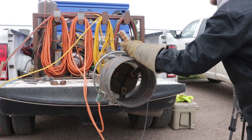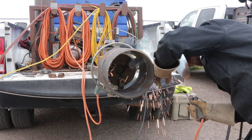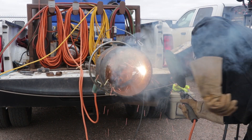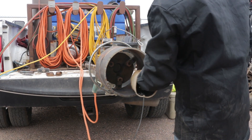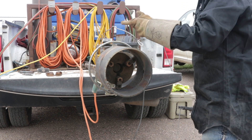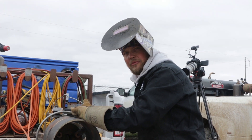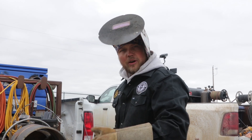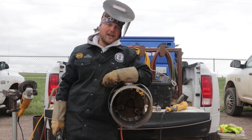We're coming into a keyhole, so I'm going to turn down five right there — keyholes don't really have any landing on them, but the pipe can control a bunch of the heat. That's the tight side. If it stays too tight, just take the grinder, soften it again. You'll know when it's too tight because your rod's going to start spitting back at you — it's not going in, you can't hear it going in, or all the fire is on the outside of the pipe. Stop, grind where it starts spitting back, start above it, run back into it. Simple as that.